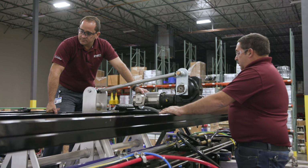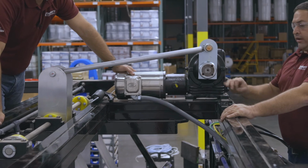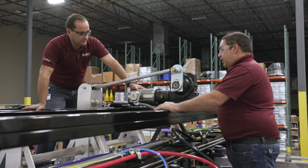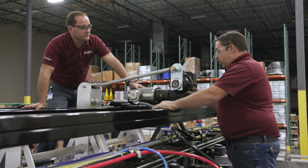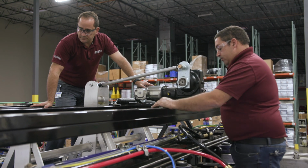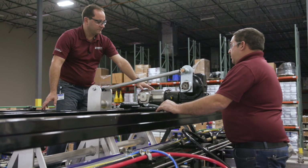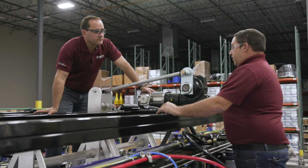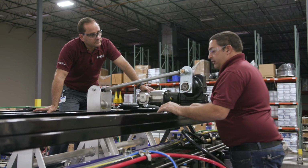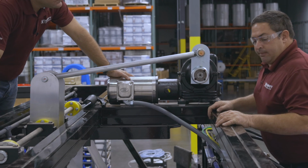What are some signs of wear of the UHMW bearings? Some signs of wear are going to be noise associated with the aluminum rubbing on the axle rods and/or jerking of the basket. So when that starts to happen, what's the best remedy? Well, really the best remedy is climbing up and taking a look. And we want to shake the basket and we want to check the bearings themselves. We're looking to see anything oblong or anything in the way.